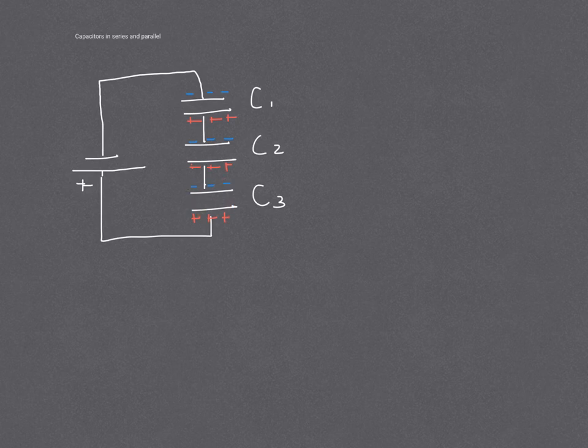So there's basically a charge separation total here. You're not adding them together. Whatever that charge is, that charge is. So whatever the amount of positive here is going to be the amount of positive here — it's going to be the same amount of positive charge here. Because this is going to pull an equal amount of charge, leaving an equal amount of charge, pulling an equal amount of charge, leaving an equal amount of charge. So what's the same across each of these capacitors now is the amount of charge. There was only a certain amount that was put onto this — this is just the charge separation. Everything here is neutral. So really there's a total charge basically just equal to whatever one of these is. It's not a charge here plus a charge here plus a charge here. It's just the charge. So the charge is constant in series.